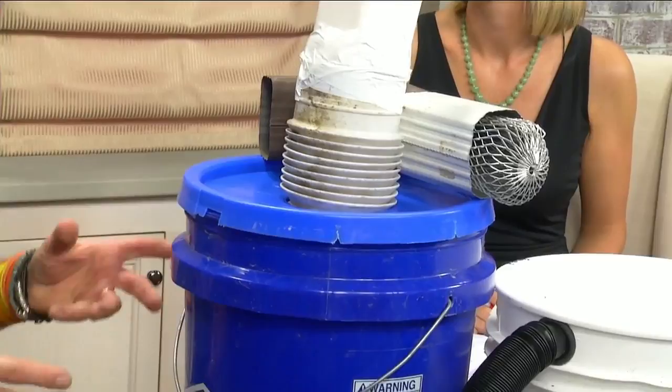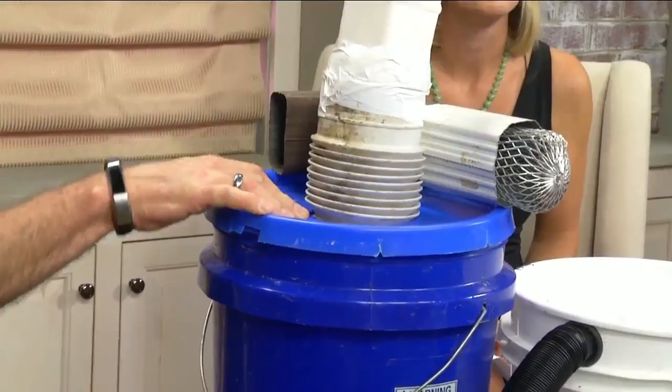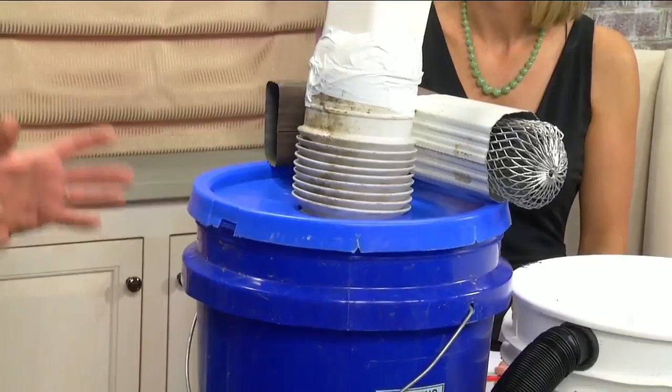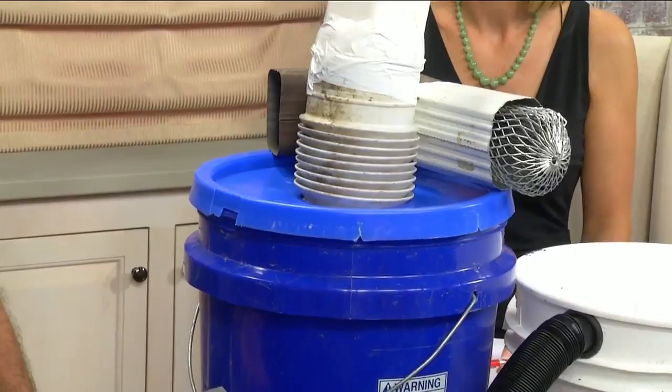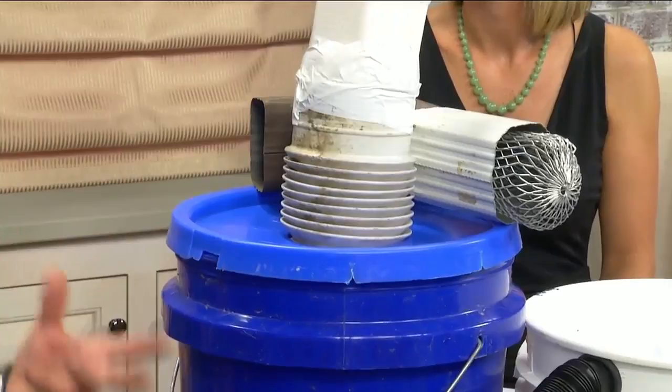There are a number of ways to approach it. These are miniaturized versions — five-gallon buckets — which you'd fill up in about two seconds with an average rain. That's because rainfall will fill up about half a gallon per one square foot of roof area for every one inch of rain. We recommend 40 to 55-gallon buckets. You can get them for free — look online, find things being thrown out, or use trash cans — just make sure they're clean and haven't had any toxins in them.